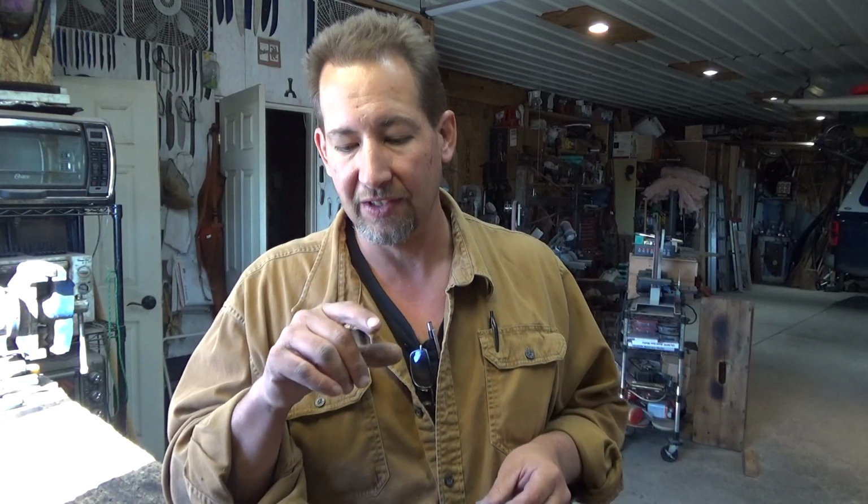And getting extreme rates of reduction. All right, my power hammer is only like a 50 or 60-pound power hammer or something like that, so I can't work with that 6-inch round bar type stuff. But I did notice the big difference in between 5/8-inch round bar and 1-inch round bar. Not so much of a difference between 1-inch and 2-inch round bar, but there still was a difference.